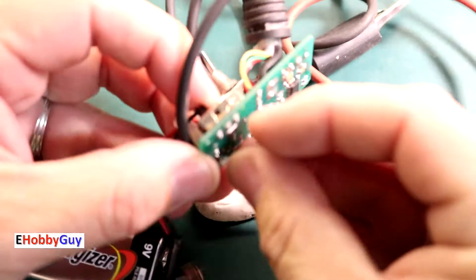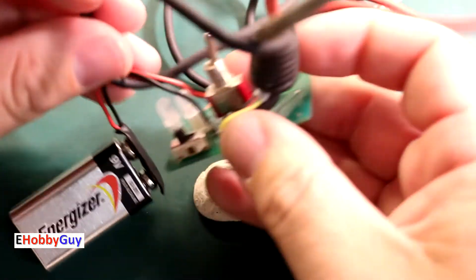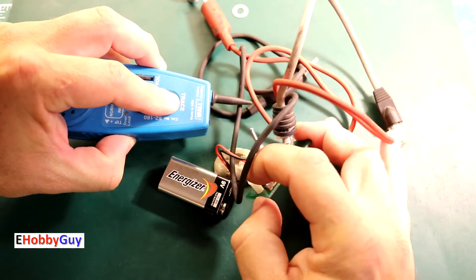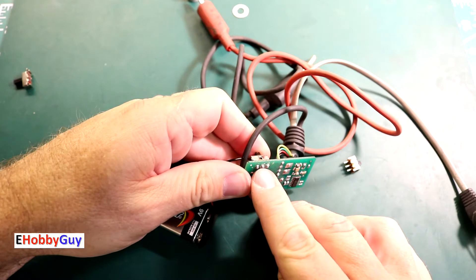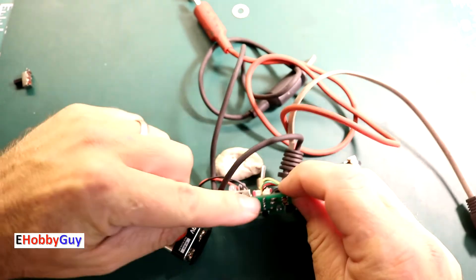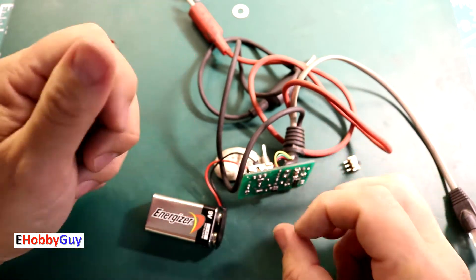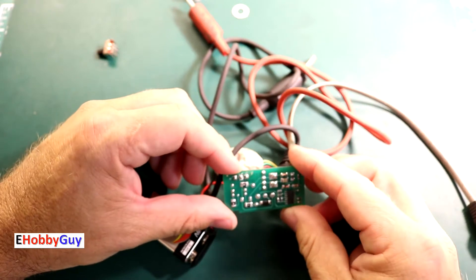The first course of action would be to get this switch off, but the pin pitch may not match. The only function of this switch is to select whether the tone is a fast tone or a slow tone. As a quick short-term solution, if I just bridge the center pin to either the fast or slow pin with a piece of wire, we would probably get a completely reliable tone generator. If we want both tones we have to replace the switch. The reason there are two tones is you could use two tracers — fast tone on one wire, slow tone on another — and identify them in the field.